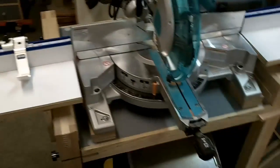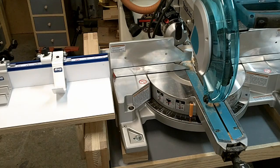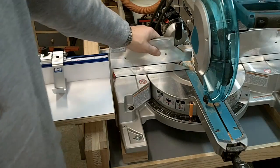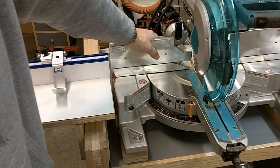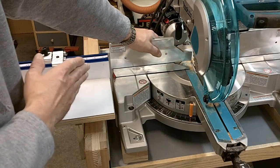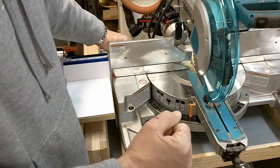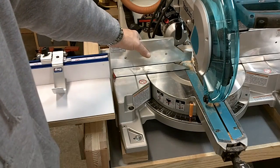There's a lot of talk about the accuracy of miter saws in fine woodworking — mainly that they're great for cutting rough lumber but can't be used for fine furniture because they're not very accurate. I say that's a lot of BS. All of these are adjustable and can all be calibrated. If you take your time — it took me probably about two hours to set this up correctly — I know I'm perfectly 90 degrees and I know that blade is perfectly perpendicular to the fence. There are lock nuts underneath the fence where you can move it back and forth. It's a trial and error thing, but once it's set up, it should keep that setup for quite a long time.